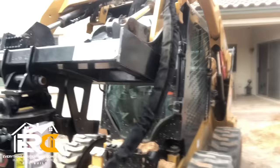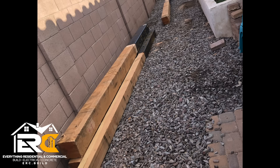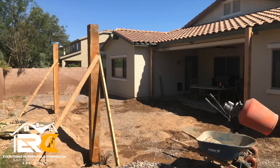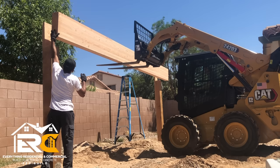As you see here we're digging six-foot piers — the pole has to go six feet deep into the ground. So we have to get quarter-inch steel. You see Nate right there with the planer — we planed the post, put the steel as a sleeve around it, and then bolt it. You see the bolts up there. Once bolted and secured we popped them in place, called for an inspection, and they approved it. This is the engineer and architect handling this. It can withstand 115 mile-an-hour winds for three-second durations — that's what it's engineered for.